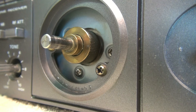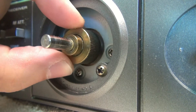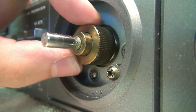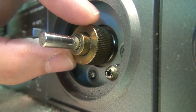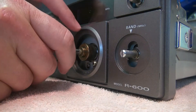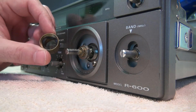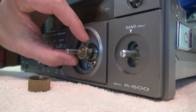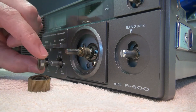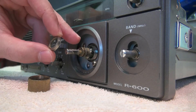I've already cleaned and lubed this thing, but let me show you how easy it is. There's a collar here — it's a brass collar. You can just spin that off, and as you do it, you're going to see this shaft here starting to work its way out, because you're retracting the balls on the vernier. Do this nice and slowly. As we retract this collar, it's going to come off. Behind the collar there's a little spring, and there's a little collar with a bevel that rides on the ball bearings. Pretty much all you have to do is clean this area, maybe with some alcohol or a little lacquer thinner, and get all the old lube off of it.